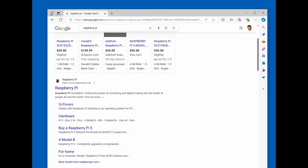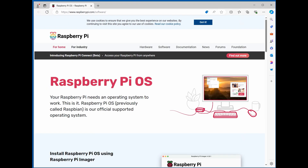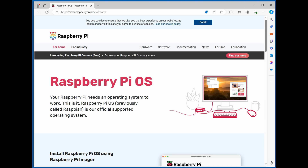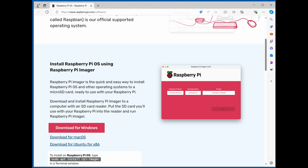I'll go into Google and find the Raspberry Pi software. I typed in Raspberry Pi and clicked on Software. In the Raspberry Pi software site, it explains what you need to install the software on the SD card. I need to download the imager tool — it's downloading imager version 1.8.5 at the time this was filmed, and it's changing all the time.